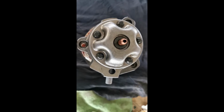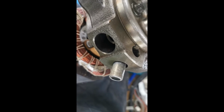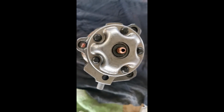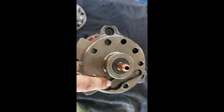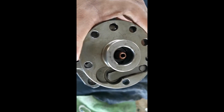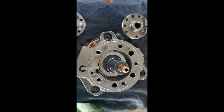Here is a teardown of a rotary compressor. This is the stator and suction port. The single-vane spring load chamber contains a piece of aluminum pipe so it can be identified. With the bolts and top plate removed, here is the discharge reed valve. Removal of this component reveals the sliding vane, rotor and eccentric on which it rotates.